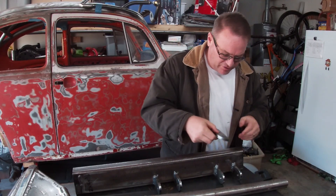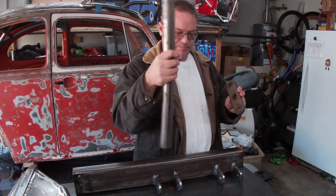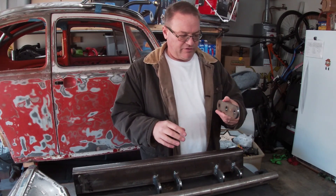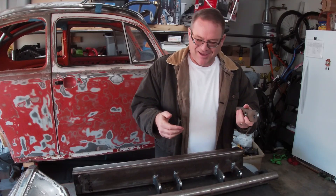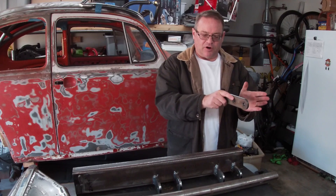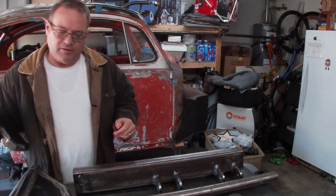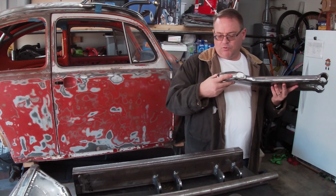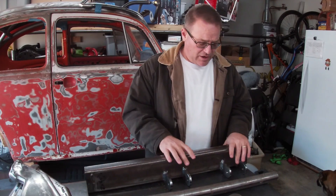I got more of the six-inch long shackles. The thought is I'm going to punch out the holes so the tube will stick right through them, run these tubes through the plate. That'll allow me — and this is the genius of my plan — to put my lower arm in, then as I put my upper arm in I can scoot it along those two bars, sliding it forward and back until my hinge joints are right on top of each other at zero degrees caster.